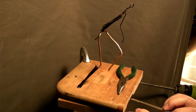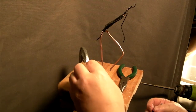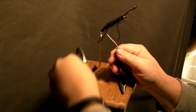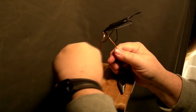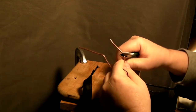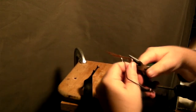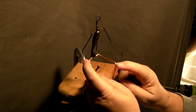I've got it just a little too long. Taking that off might work in my favor — it gives me extra length to attach to the base. It's never good to start something off wrong. Let me rebend this, straighten that out, and bend the knee right there. You've got to be careful when you nick the copper tubing — if you bend it too much at the nick, it'll break.